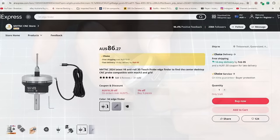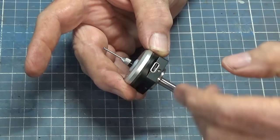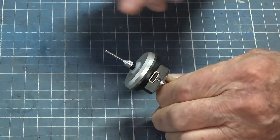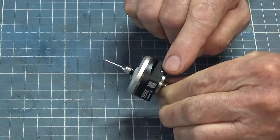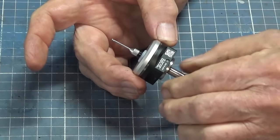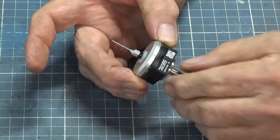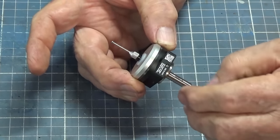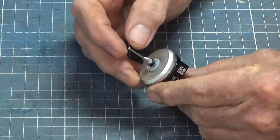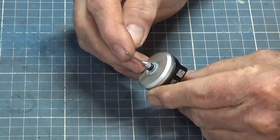Now I bought this on AliExpress, and I think from memory it cost about $120. I'll leave a link in the description if you want to find this particular tool. They're made in China, but they're actually very, very well made. This has four screws around the spindle, which allow you to centre it if it's not concentric. But I find that straight from the factory, they're already accurate and you don't need to do anything to adjust them. Now, the stylus tip is 2 millimetres in diameter and it's just hardened steel.